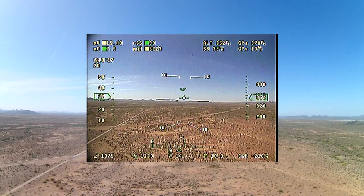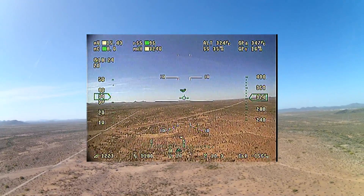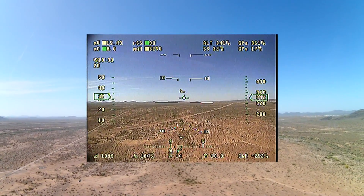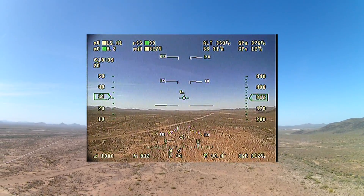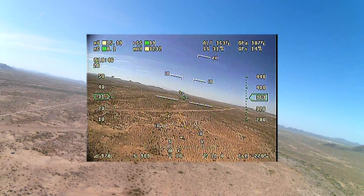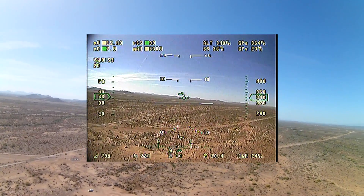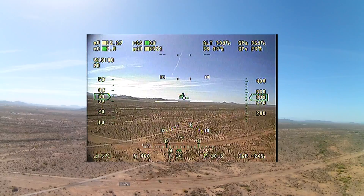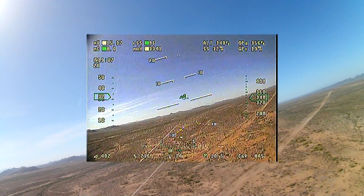I left the volume up there so you could hear the wind on the ground recorder - it was really blowing pretty hard. You can see some minor change in altitude in this flight mode. Remember, this is not a hold mode - this is just keeping the plane level. So all I needed was a couple of clicks of trim and I got this dialed right back in again. When I went into the menu later on to copy my gain values in, I incorporated trims again. Subsequent flights in 2D mode were really amazing with the amount of wind that we had, so I'm definitely happy with the outcome of tuning the basic gains.